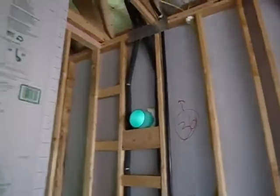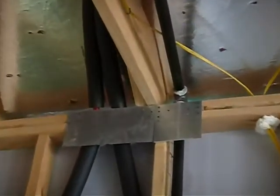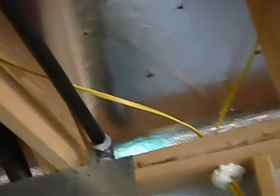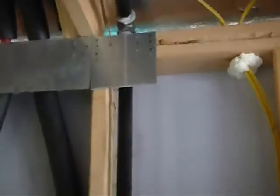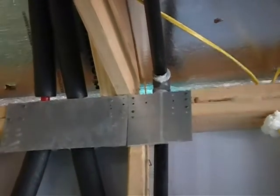And then over here on the plumbing, see the nailing strip right there? See the piping behind there? That red, that's PEX. That's uninsulated piping. And I can see the edge of another piece of piping. So right here, and this is a soffit. You see the light coming through? That's the air just coming through. Unconditioned air right from the exterior, just blowing down on that.